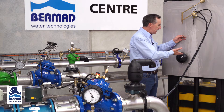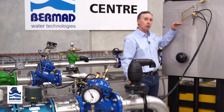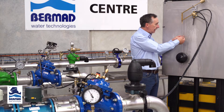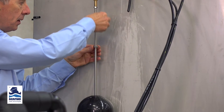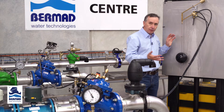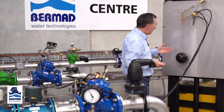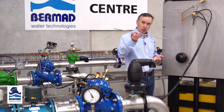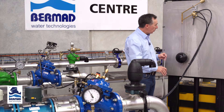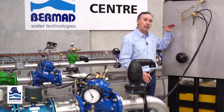The next step is to set the stopper on the float just below the top water level where you want the valve to close. With a small allen key you can adjust these stoppers up and down. There is also a stopper on the bottom you can adjust, and if necessary an additional shaft can be connected to the bottom to extend the differential between closing and opening. Simply set those stoppers until you're at the top water level.